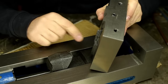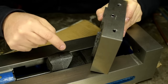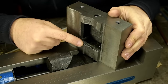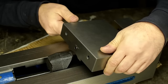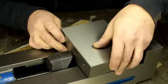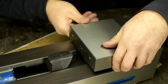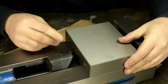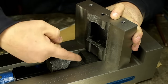Thing is, the two angled surfaces usually have a spherical element between the two of them, like a hardened steel ball. That creates a more efficient transfer of force from this angled face to the angled face inside of the moving jaw. You probably can't see it, but these are just rough cast surfaces. I mean, really bad stuff. It's like lunar surface type casting. And you can imagine if those two mating surfaces aren't clean and parallel, the component of that force that pushes down, well, I guess even pushing in, could try to kick the moving jaw all over the place. And then it would rely heavily on just the small machined features that keep this aligned to the body, right? The body drops in that little machined track or groove or slot. That's actually pretty good. But those would have to resist any weird torque from this angle clamping feature. As it is, it's really just two rough cast faces covered in grease.